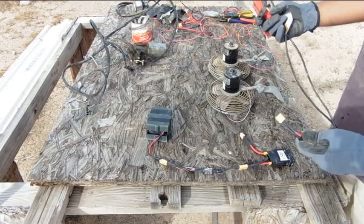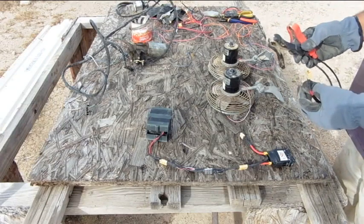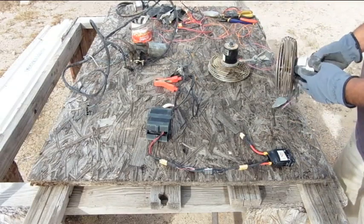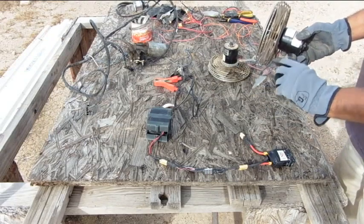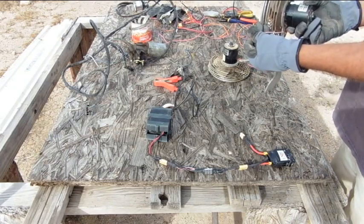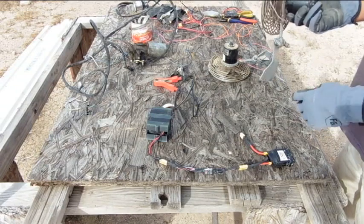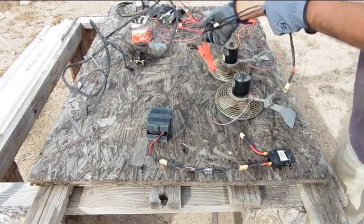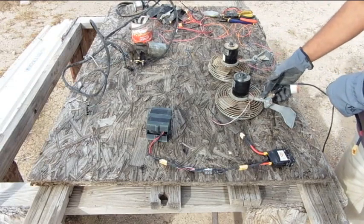I found these random little things — this was off of my battery charger. These fans, in fact the label says use a three-position switch: high is the red wire, low is the black wire, and base is ground. You can't just run red to positive and black to ground — it won't work. That's for high and low settings, so you can run this on two speeds. Then you have to ground the base.